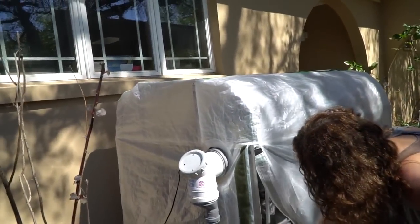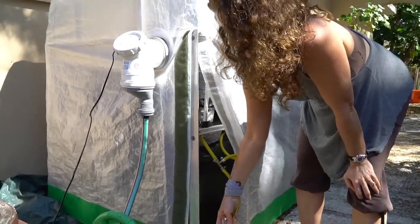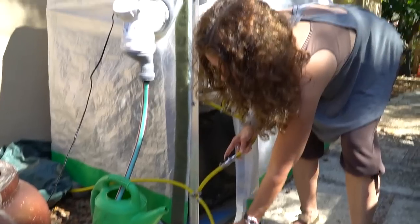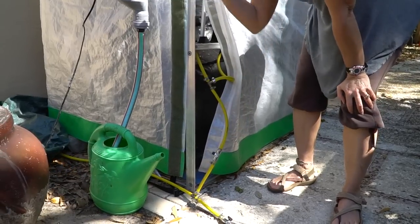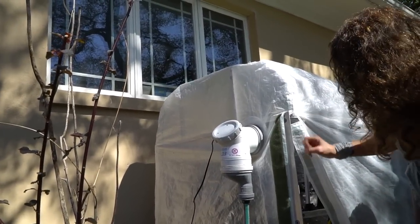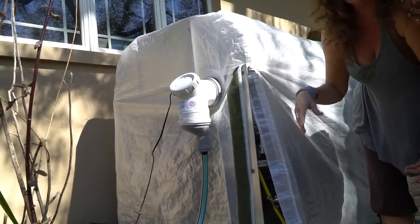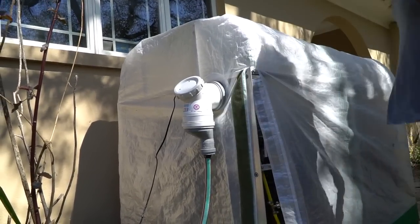Let's show everybody what the output is. The gas is stored in this tank, connected to this tube — right now I've got it closed because I've been testing various appliances. This is just a little drainage outlet where condensation may form. When we open this valve, I can then go turn on the stove and light it up. This is where the fertilizer comes out, and also where the burping happens — excess gas goes out this tube into the air.